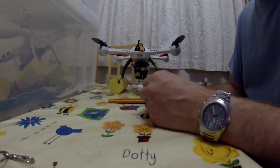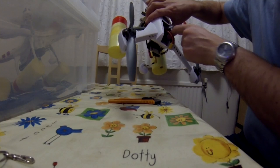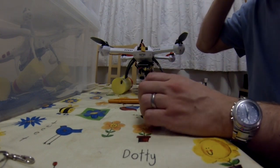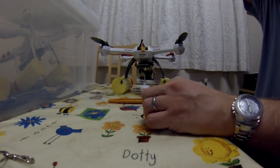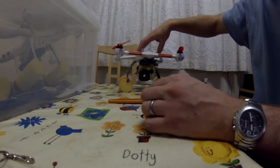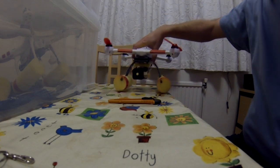I found the range is quite limited — not so much when it's facing away from you, because the aerial on the board is facing the back. So when you're flying away from you, the range was no issue at all, out to probably 1200 feet. The problem is when you turn and come back, because then the battery and everything else is in the way, and that's when I found I was losing RC control.